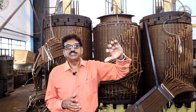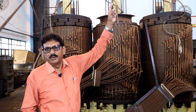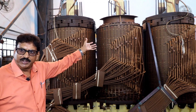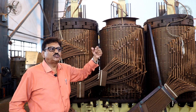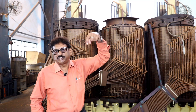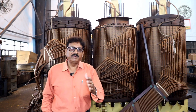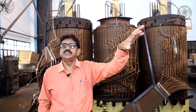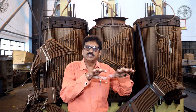The entire drying process is completed. After the transformer is dried, the original tank is used for tanking. It can be lifted by the EOT crane because it has significant weight — about 30 to 35 or 40 tons. The EOT crane is most useful for alignment during loading and unloading. When the heating process is completed, the assembly is immediately tanked. After tanking, the top plate and gaskets — which have already been replaced beforehand — are fitted and the top plate assembly is completed.